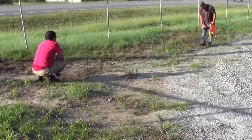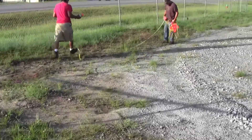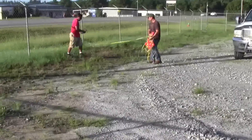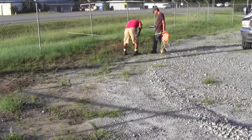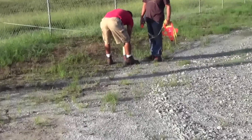Now place a mark on the ground. Whatever the length of your building is — it's 40 feet — so place a mark at each end. You will now need 12 stakes 3 feet long and 8 batter boards cut 2 feet long. Lay out your batter boards 1 foot off the two marks you have on the ground as shown.